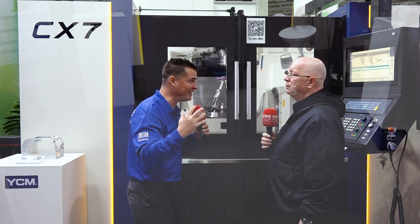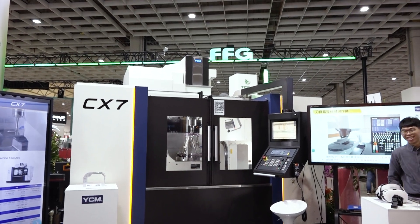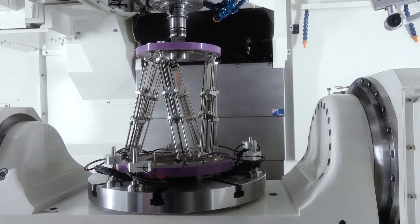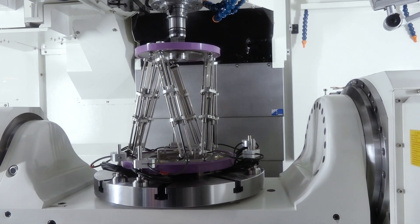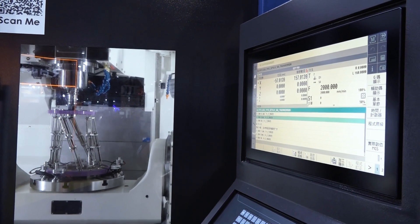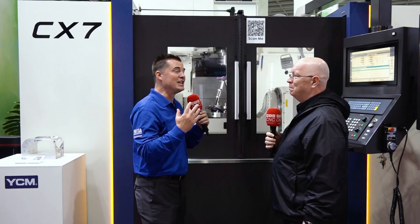Not easy to cut and expensive to scrap. I want to step back to the volumetric accuracy, because I think it's very important for the audience to understand the difference between 5-axis machining and high-quality 5-axis machining. In layman's terms, it's about the distance from the table to a bigger workpiece. The further we get away from the table, the harder it is to create true micronic accuracy. What we're doing here is making sure that that accuracy exists. Volumetric accuracy gives us the ability to stay accurate within the full range of travel — that's what you want on a full 5-axis machine.